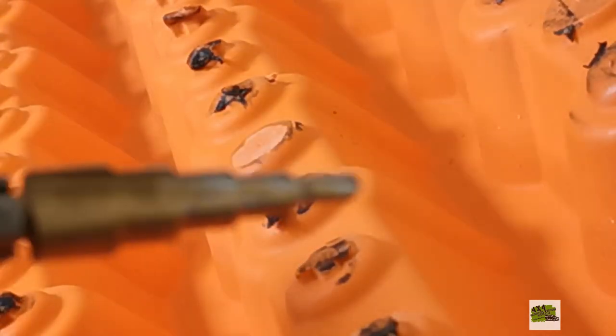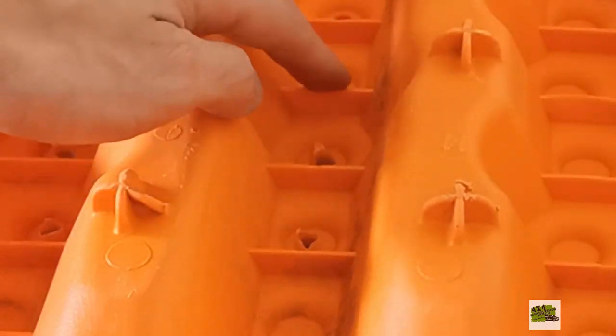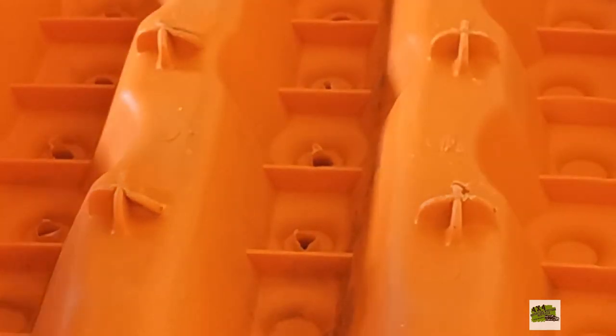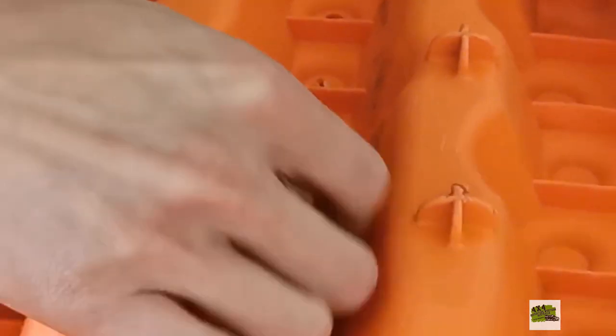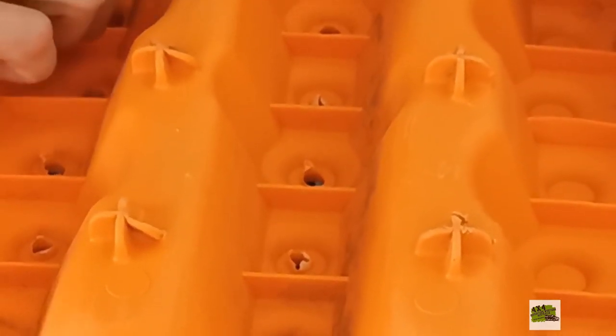Then I'm using a step drill bit. Drill until it reaches number 8 — that means 8mm diameter hole. You can see there's a hole there. From the back you just have to get rid of the excess, so clean it up a little bit using the drill, push it back a little bit, and use the drill to clean up the trims. It makes a really good contact area for the bolt to go through.